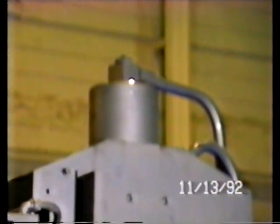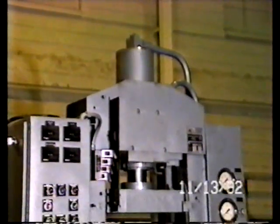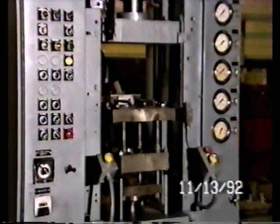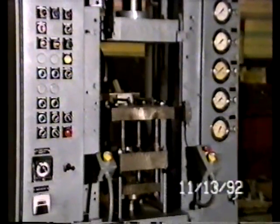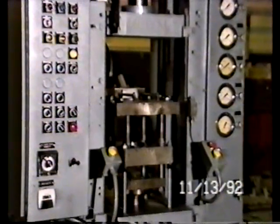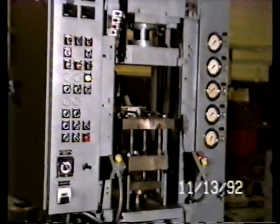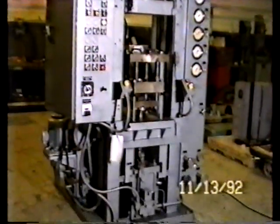The top of the press is the upper hydraulic cylinder, and the upper and lower hydraulic cylinders control the motion of the upper punch platen down for compaction or up for retracting, or forced hydraulic movement of the die table during the movement of the die table, either during compaction or for ejection when it withdraws down over the fixed lower punch, which is the tooling method of a withdrawal tool motion or floating die table type of die set press.